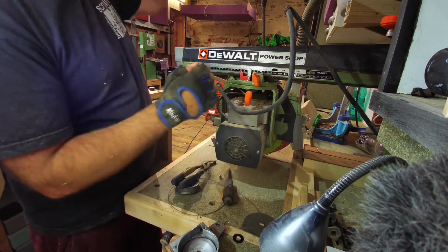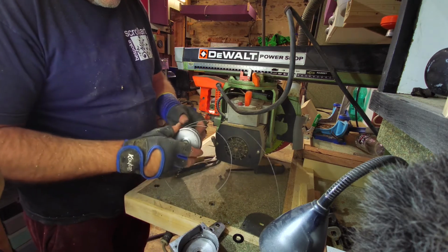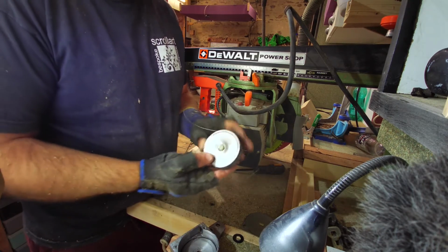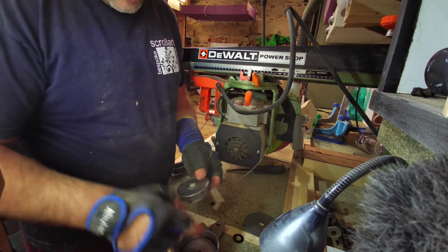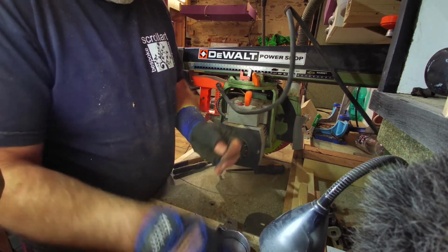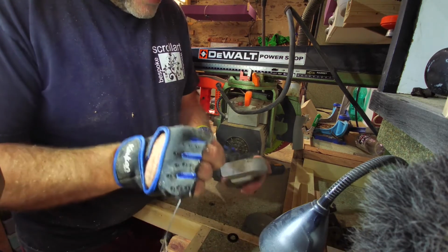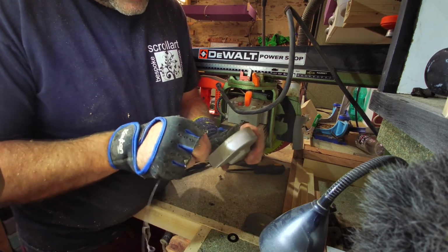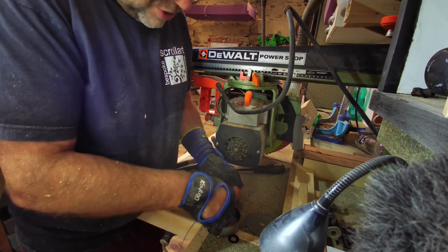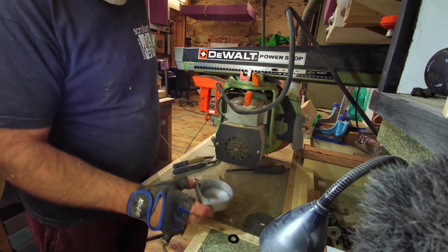So that's the old piece of cable which is knackered. That's my French, but it is. And this is the new, well, not new cable, isn't new at all. Anyway, this is the device. The side with the slot goes into the hole, so it goes that way round, like so. I've got to thread this through that hole. It doesn't matter that it's not wound on yet, because that'll get sorted when we tension it with the faceplate. So I'm just pulling that through the hole like so.